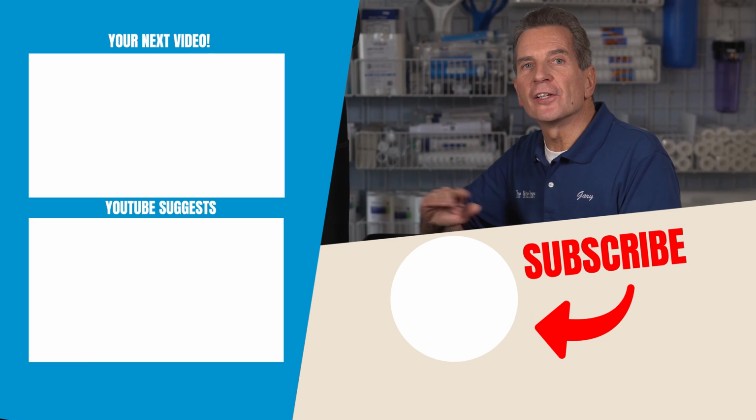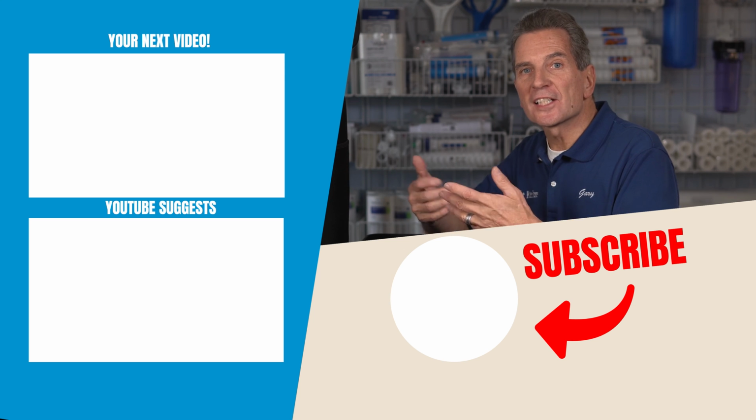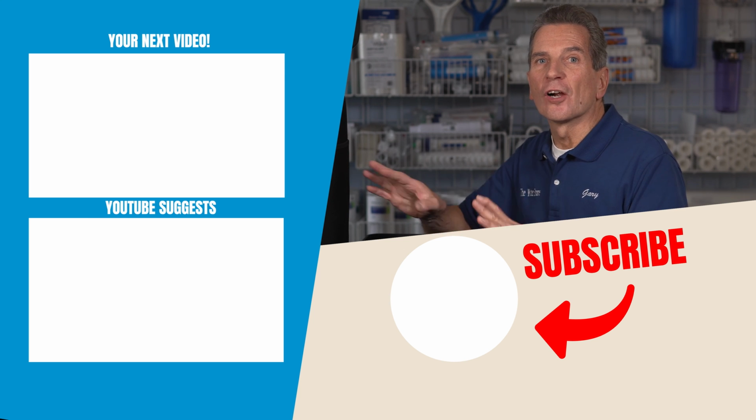If your water changes color, if suddenly you're getting some brown water, etc., coming from the water softener, it's a good time to go through this disinfection procedure. If the water tastes awful, again, great time to do that. If you replace the resin, it's a good time to sanitize it or disinfect it to make sure that the smell doesn't show up. And if all those things aren't happening in your world, then what I do recommend is after 5 years, every water softener should be disinfected, just to make sure that you keep it at bay so that it doesn't get so bad that you get that awful garbage smell.